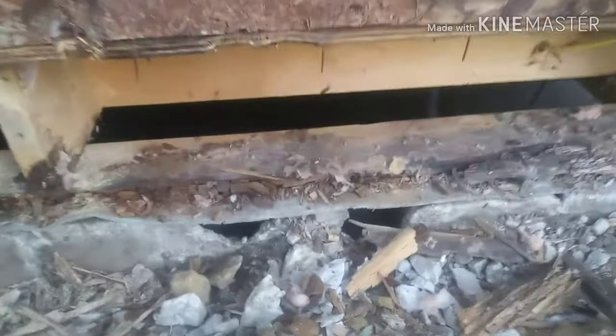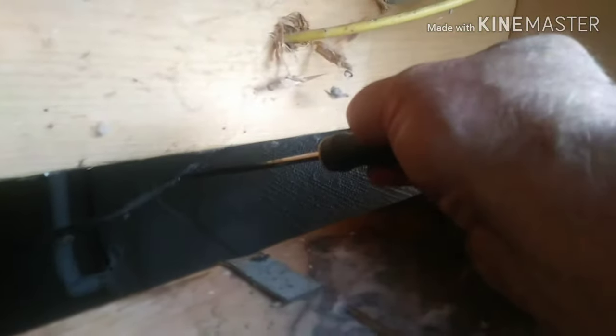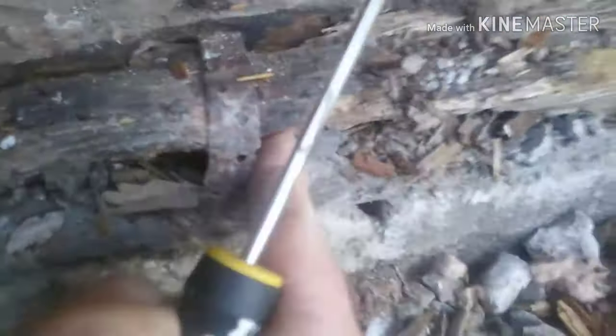The block and the sill plate below it — I think that's what saved this thing from sagging any more than it has. You can see this thing is just gone. You can see the wires and stuff in there, so you've got to be careful. There was a cable stapled to the back side of the sill plate, and then you've got the sill plate straps — get the nails out of those or cut them; they're all rusted off anyway.